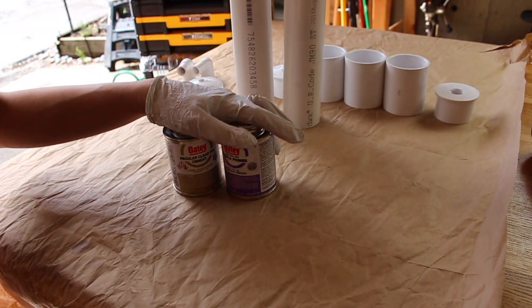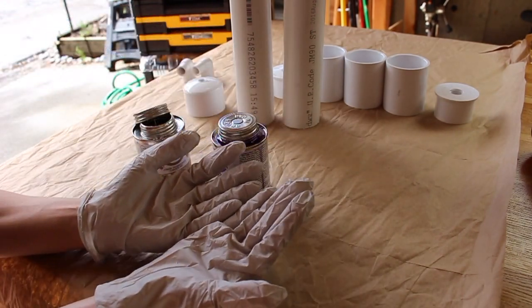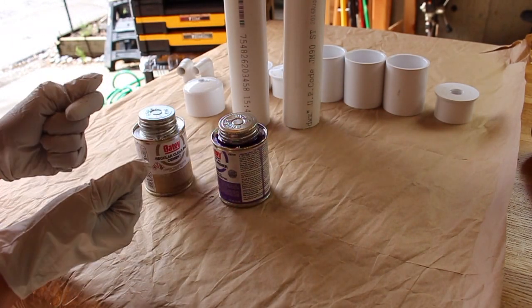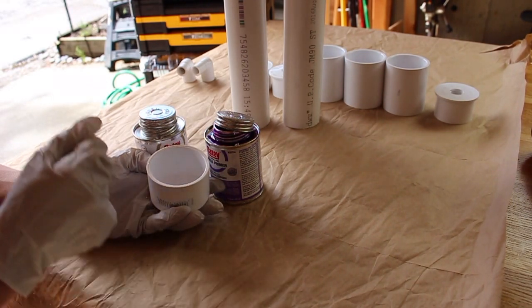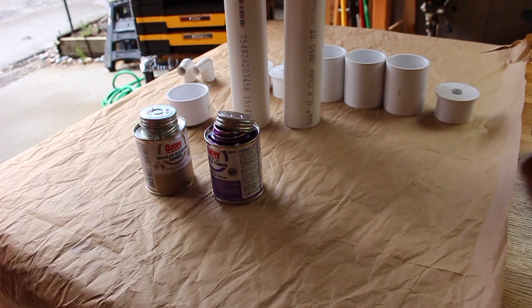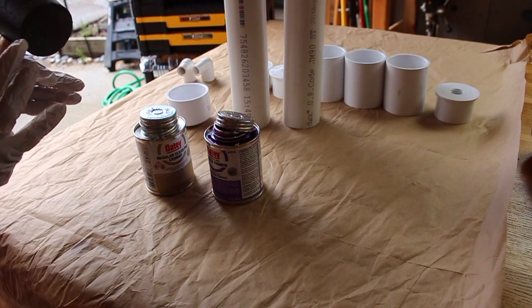I will be using the clear PVC cement and the purple primer. These come in a combo pack for like 8 bucks at Home Depot, so it's pretty cheap, and you'll be able to glue a lot of stuff with one can. When you're doing this, if you're using primer and glue — mainly primer — make sure to wear gloves. You'll notice it's starting to eat away at your gloves, but it won't eat through them unless you dunk your hand in there. How this is going to work is we're going to take primer and quickly coat each surface that we want to join. And while the primer is still wet, we're going to slather some cement on both surfaces, just like we did with our primer. Then once you have them together, you're going to take a mallet and pound them together, because sometimes they kind of want to separate slowly due to air bubbles. If you leave that unnoticed, your PVC will almost completely separate.